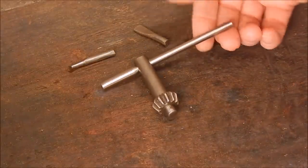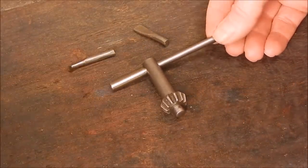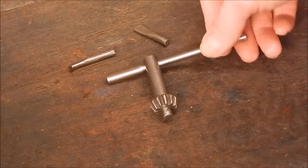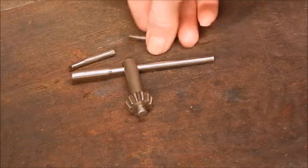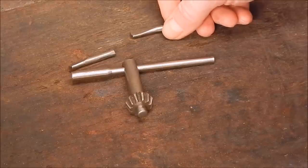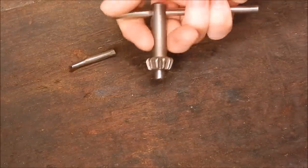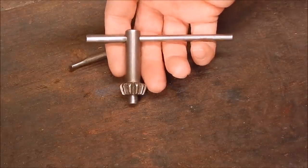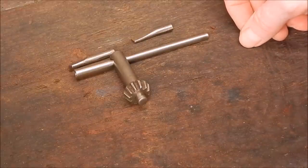Well there you go, she's turned out pretty right. It's not machine grade steel by any stretch, but the finish is reasonable — not too bad. Now I'll just heat up the end and flatten it, the same as done on the original. That'll stop the little crossbar from sliding out, and job's done. It'll be a nice good size to grip — a lot of them are too short, but Jacobs ones are generally pretty good.